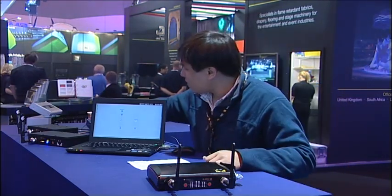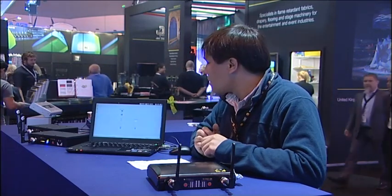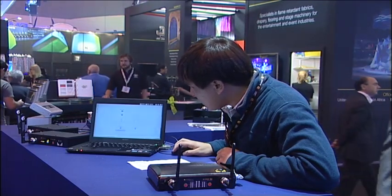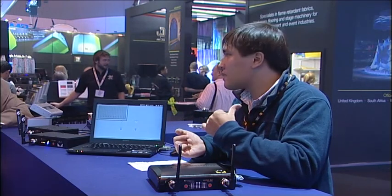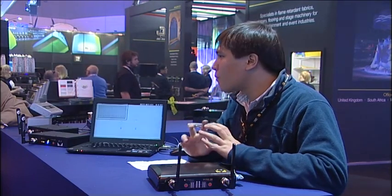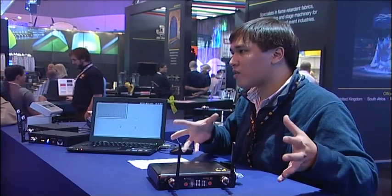One last thing: our standard Blue Box nodes do Ethernet-to-DMX conversion, and we do have standalone DMX controller functionality. If I click on this button, I can see the DMX controller functionality. The great thing about the standalone boxes is that they'll work with any standard five-pin DMX source as well. So I can run in standard five-pin DMX and get out DMX and RDM merged together with RDM control from this software. We think we're the only company doing this today — the ability to merge a standard five-pin DMX signal with RDM and have RDM control and DMX control from a separate standalone device.